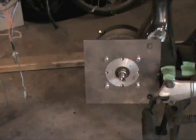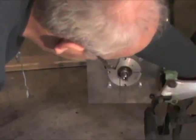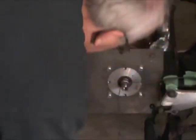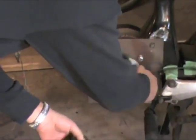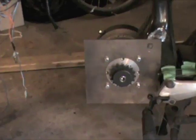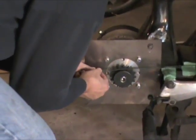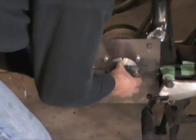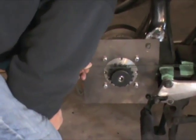Here you can see I've actually got the motor on. This will line up with my sprocket — lining up with the pivot point at the back with the weight down. I have a sprocket here and a key — a little key I made up, as it didn't come with the sprocket. In goes the sprocket. I'll stick a chain on and see how it looks. Looking pretty in line. If I take these strings and pull them up beside it, it's really fairly straight. I've left it so I can come out a little with the cog if I want to, to straighten it up. Don't bring the motor out too far if you're up against the collar — you can always bring it out and drill holes into the shaft to lock the cog in, so you can realign your chain a little bit.